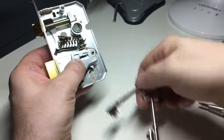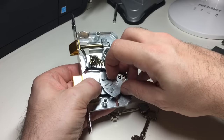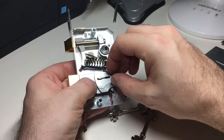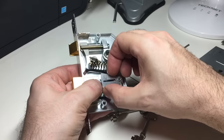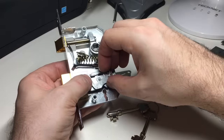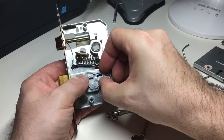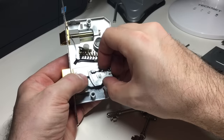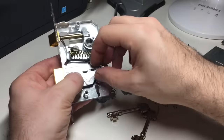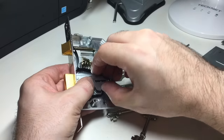So let's gut this and you'll see where our tension is. These are the levers that you're picking — that's lever three. There's a little plate which acts like a washer between those levers. Lever two, and you can see how that has to be lifted up just enough when you've got tension on the bolt. Move that one out, and take this little spacer out, so there we go.